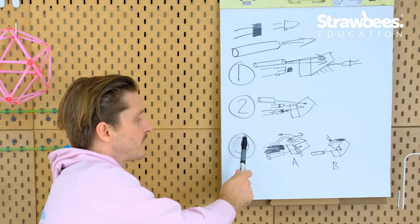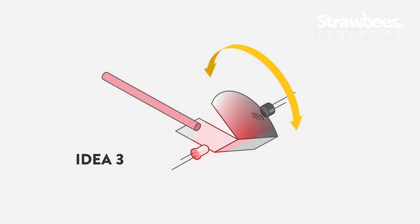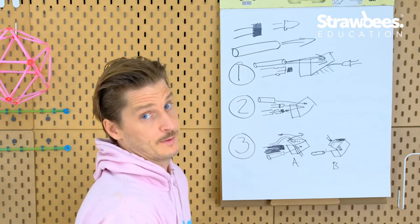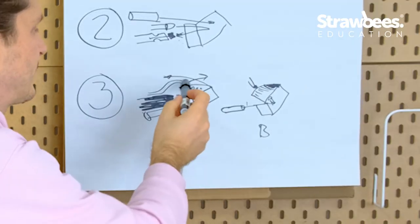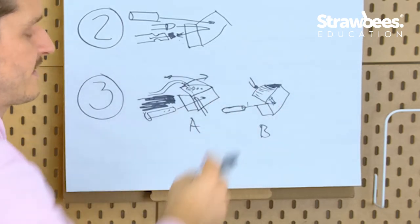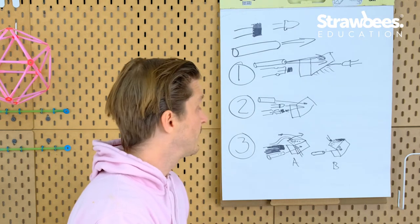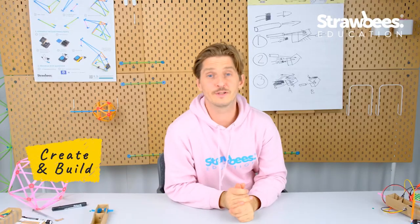So if you blow really hard, you have a low value in that case, because it lets light just go on. Final version, a sensor on one side of a piece of paper folded out from a flap that folds forward and backwards, depending on how hard you blow, so I can have a gradient or holes that let light through the paper into the sensor. So the LED is on this side shooting light, and a light sensor is on the other side of the paper. One goes through the paper through holes and another goes through a gradient, which is a really cool idea that I think will work.